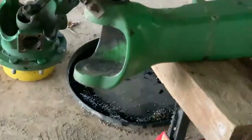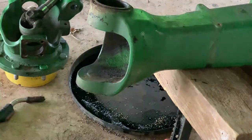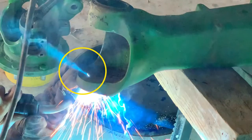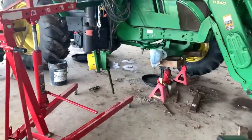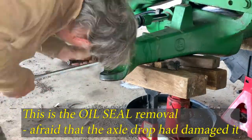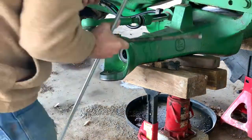I just start hitting it — there it is, that's the raceway it was contacting. I cleaned everything out, then welded the ring race so that it would shrink. First time I tried, I got the crowbar in there, leveraged it, and it popped right out. Now let's weld the bottom one and try to get it out. The kingpin had actually created a hole in the casting — there was damage.